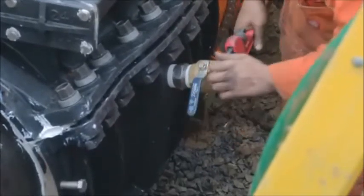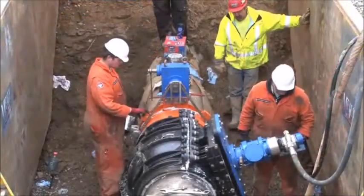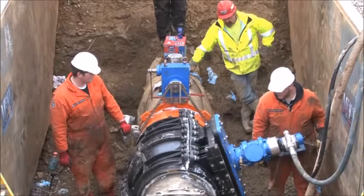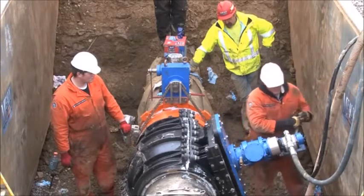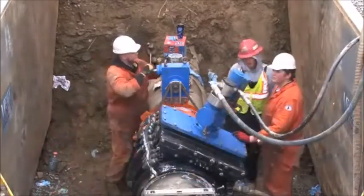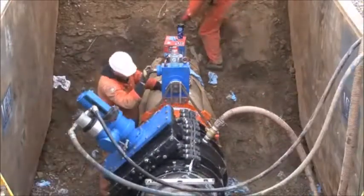The chip flush hose is attached. The EZ II valve system removes all of the chips created by the end mill cutting process. The valve assembly with cutter is rotated to the start point of the drive ring. The pipe is pierced and the end mill is locked into place. The valve is then rotated to the cut point designated by the positive stops, so all the guesswork is taken out of the rotating process.